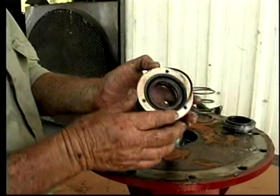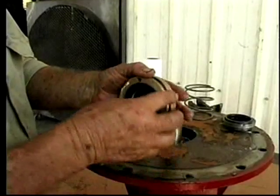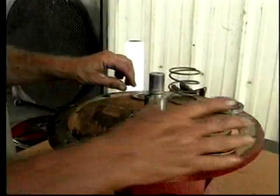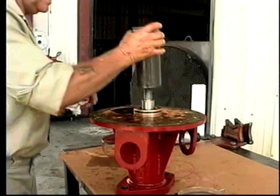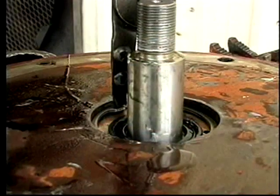Install the O-ring in the outer groove on the seal holder. Install the face for the mechanical seal into the seal holder — this goes on the side opposite the three puller holes. Install the seal holder, and while keeping pressure on the seal holder, insert the stainless bottom snap ring.